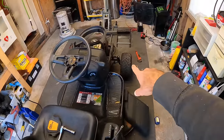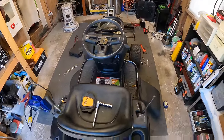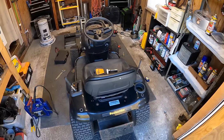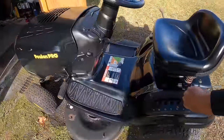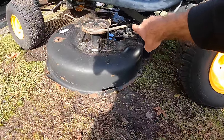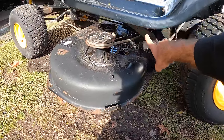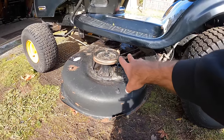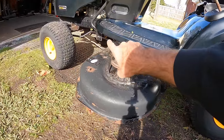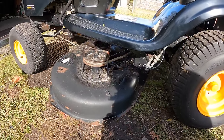I'm going to go ahead and grease the front end since I've got the jack underneath, and then bring this over to wash. Let me show you guys the deck removal — on these we just have to release the cable over there, we've got one pin here, another bracket along the side, same on both sides, the front rod needs to come down, then drop the belt and the deck slides right out from underneath. Let me get all the pins removed and slide this out.